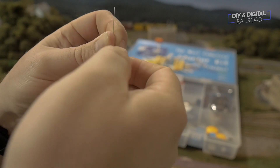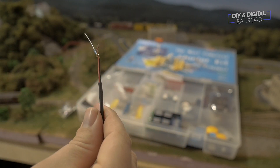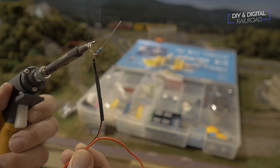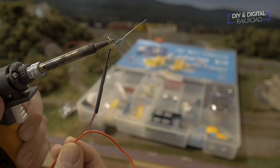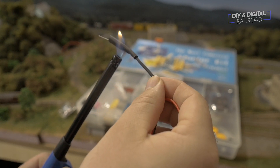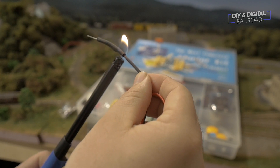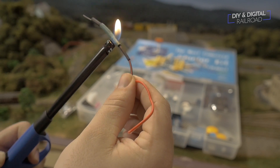The way I put this resistor in the line is by twisting up the stranded wire that I stripped and one end of the resistor. Then I take some solder and lightly put it on there, just enough to give it a good solid connection — don't put a ton on there. Next I take some heat shrink tubing and seal in that resistor. For this one I had to use a couple different levels of heat shrink to get everything all nice and snug.